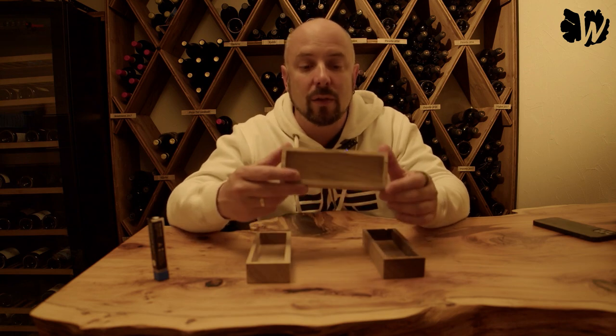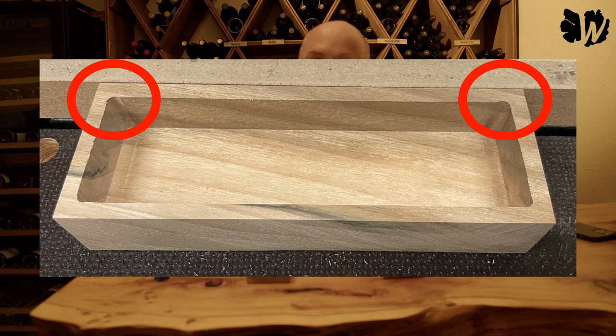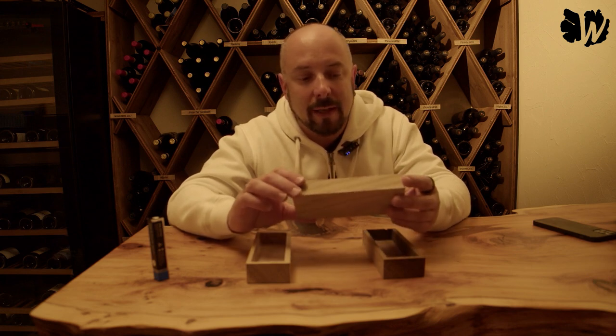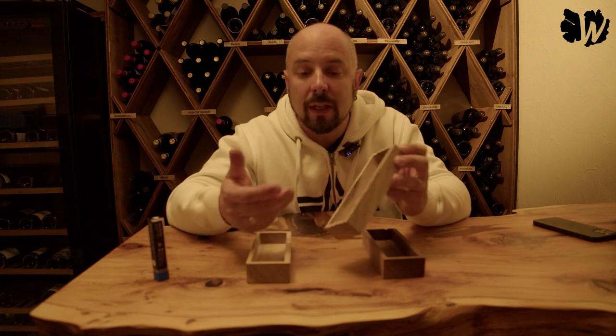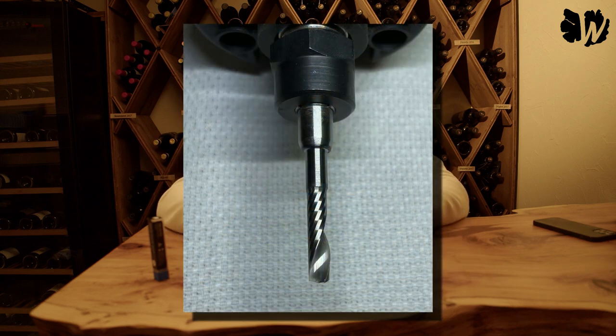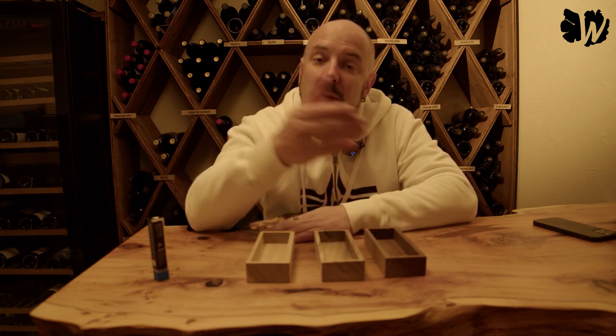The cut quality for the walnut is also pretty good. Although on the inline cuts we have in two corners a kind of dent, which I can't really explain — if you have an idea, leave it in the comments. But other than that it looks good: no burning, no tearing out of wood. After using the bit on this hardwood I didn't observe any major signs of wear — it looked pretty new, pretty unused, no frying of the bit. So I moved on to wenge.